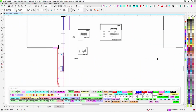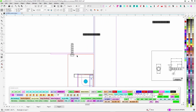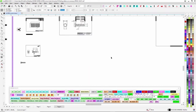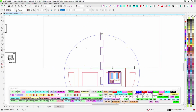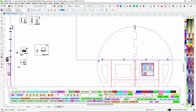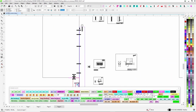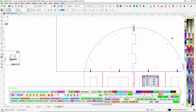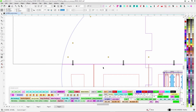This magenta would be a 10-inch plate that goes up underneath. And then I have these Tapcons, again a 2.5-inch embed, that will go in from underneath and help stabilize this axis as opposed to the front mount. And this could be done with a fairly simple 090 template or 063, just do the part that touches it and then folds underneath. And if you want to, we could put that up in place first, and then you can pre-drill all your holes.